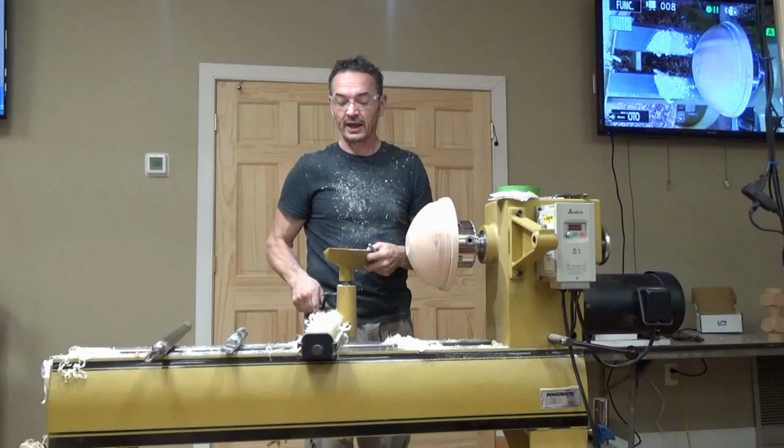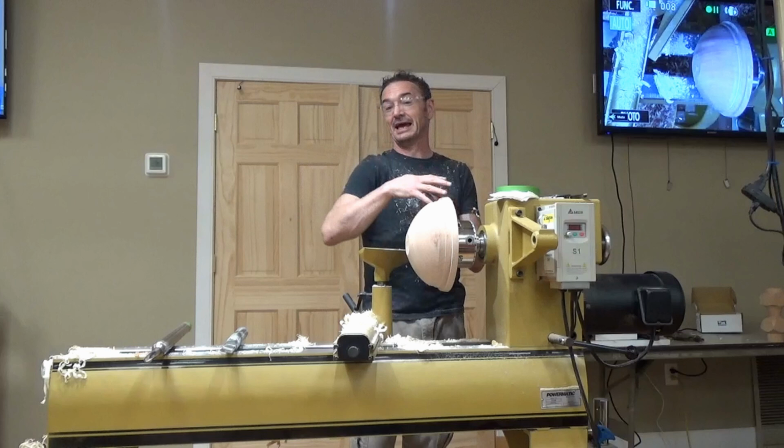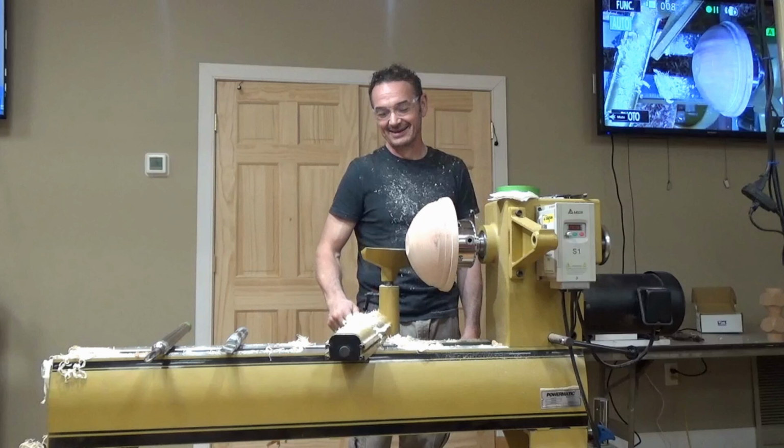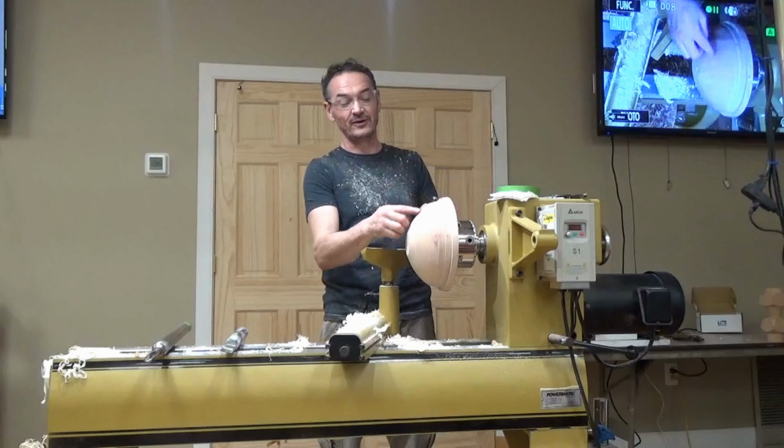The denser the wood, the fibers break really rapidly. It's more brittle, they just snap off. And so it keeps clearing its waste, keeps clearing its waste. And we saw in the ash there, it's not a bad finish for just a piece of wet old ash. In Colorado, it grows pretty quick because it's a sunny state in the Union, Colorado. So if the tree gets irrigation, ash just grows so fast, and that's why it checks. It's got more moisture in it than it really wants.